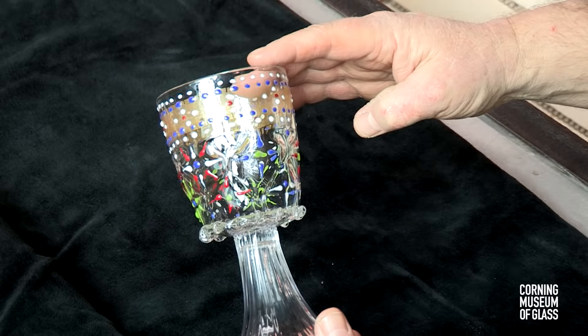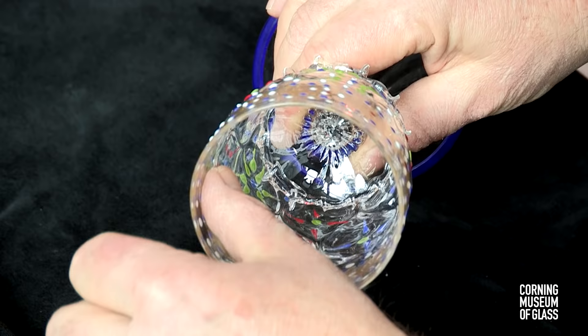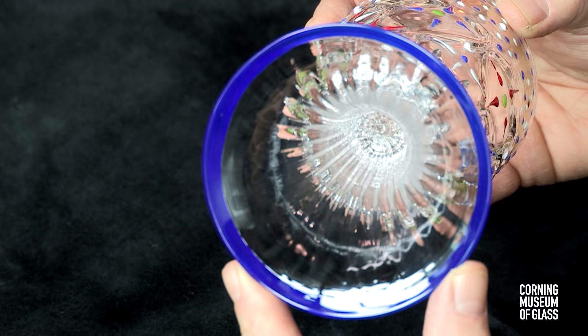Here's the bottom of the cup. Near the bottom, where the glass changed shape little, the dots change shape little. But up near the rim, the greatest change of glass is revealed by a change in shape of the dots — they become oval. The interior is slightly irregular. The dots heat faster than the clear glass, and the glass thickens under the dots. There is also a double punty mark: one from the making of the blank, and one from the decoration firing.